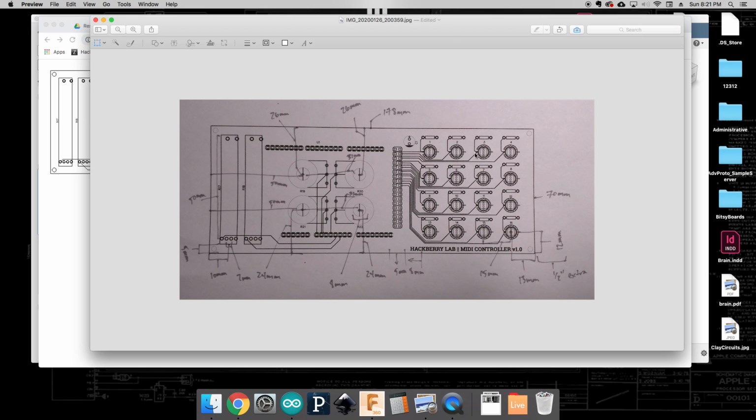The main components that we want to focus on are our sliders here. You can see that I've got 2 in my design. What I'm looking for in this case is the center point here. I can see that I'm 10 millimeters away from the edge, 5 millimeters from the bottom of the edge, and that the overall length of this is 55 millimeters. I'm going to be making some adjustments there, because we don't have to make it big enough for the entire slider to poke through, just that little arm that's going to push up through.